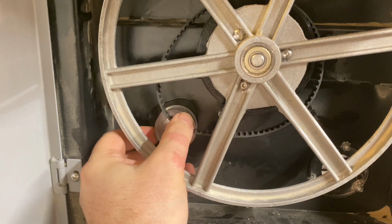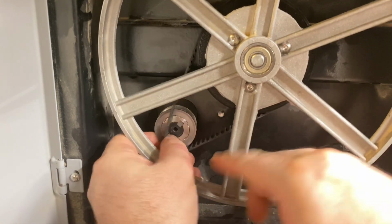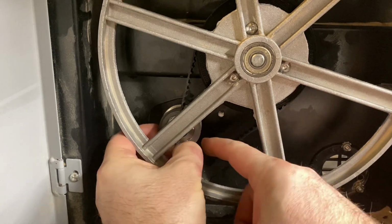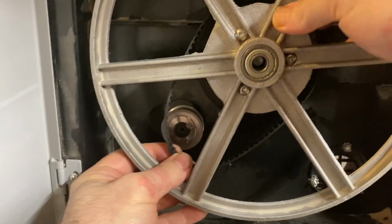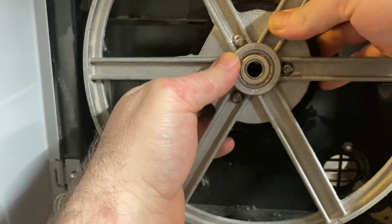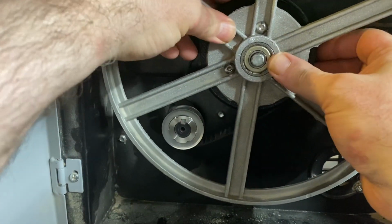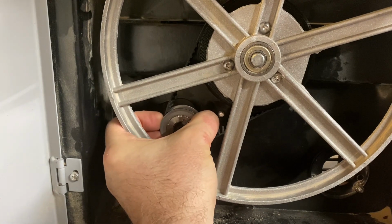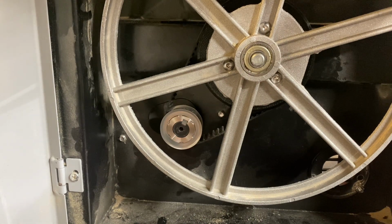And as you can see, I'm going to have to loosen the motor off of its motor mount and get this nudged over some in order to get the belt in place, I think. I've loosened the motor and the motor mount to be able to move this shaft over. I'm thinking it might be easier to put it in place and then get this positioned onto the shaft up top. All right, I wasn't getting it seated all the way down. Now I am, but I've clearly got too much angle on the belt. So having that seated all the way down in is a problem with the motor mount's current location.